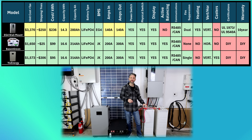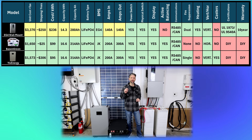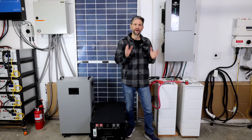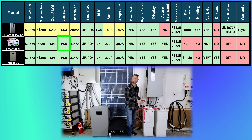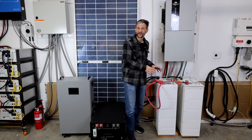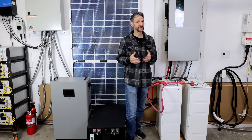The cost for the US source case with 314 amp hour batteries is $1,650 with tax included. Shipping is generally free but it does depend on where you're shipping it, and there may also be a credit card transaction fee. I have two sources for these DIY batteries — one is US and European stock, and the other is an Alibaba link with China stock. You might be able to get it much cheaper sourced directly from China, but delivery timing could take substantially longer, maybe even a month or more. Since the 314 amp hour cells have an actual capacity of 325 amp hours, this pack has a 16.6 kilowatt hour capacity, bringing the cost per kilowatt hour — not including shipping and fees — to $99 per kilowatt hour. That is super cheap. Just one of these batteries is enough to power a home's refrigerator, lights, microwave, well, and other emergency utilities for at least a day with no problem.